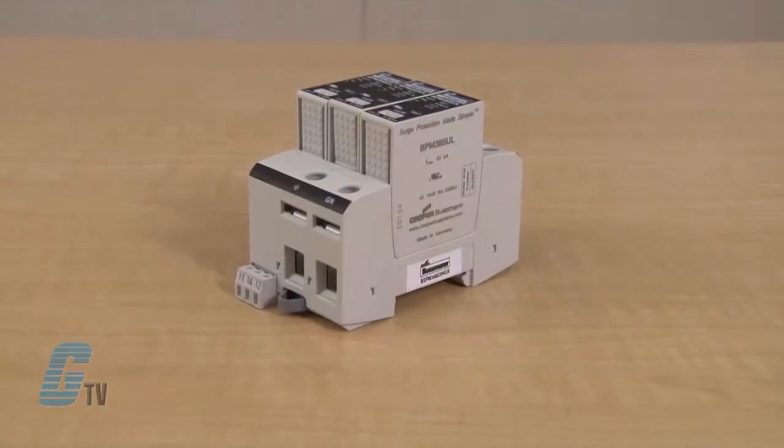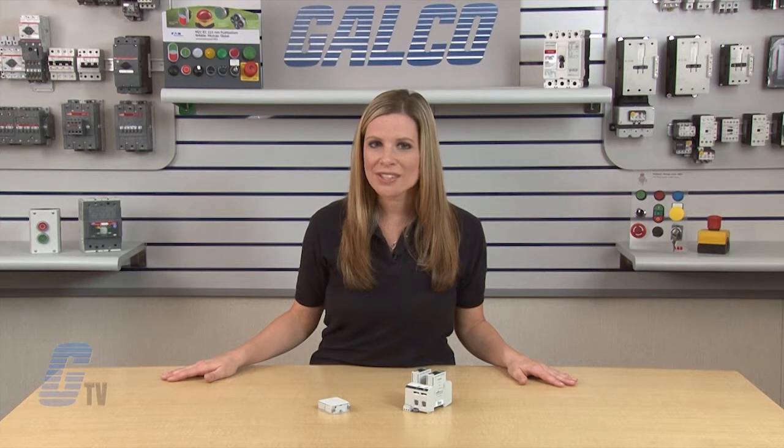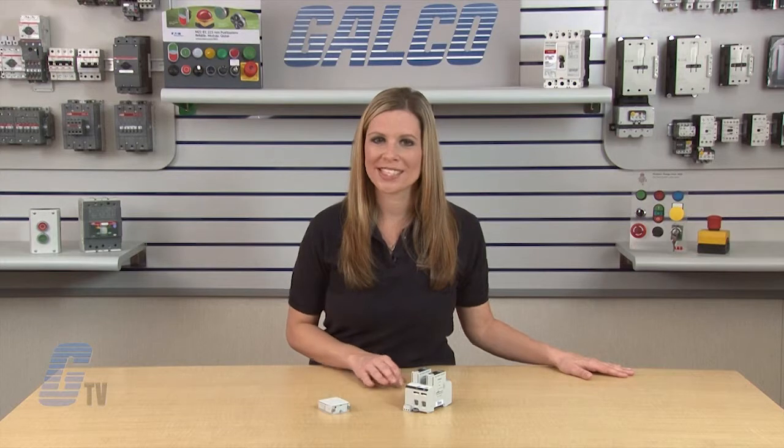The thermodynamic control SPD monitoring device ensures high reliability against surge events. These SPDs have up to a 200 kiloampere short circuit current rating that make higher assembly SCCR ratings possible. The optional remote signaling of all protection modules makes status monitoring easier and accurate in any monitoring scheme. The SPDs of this line are also vibration and shock tested according to EN 60068-2 to withstand harsh environments.